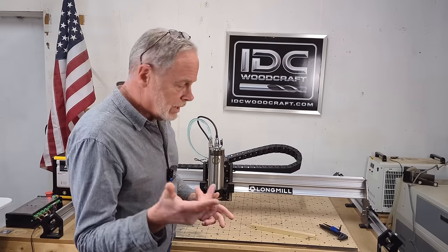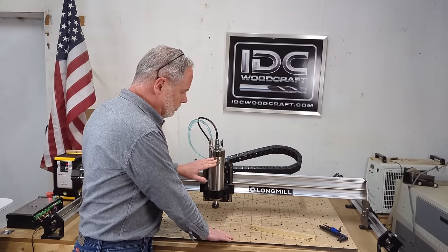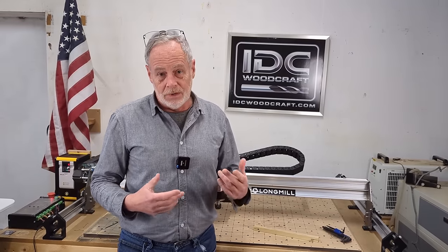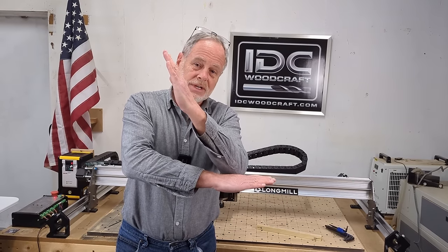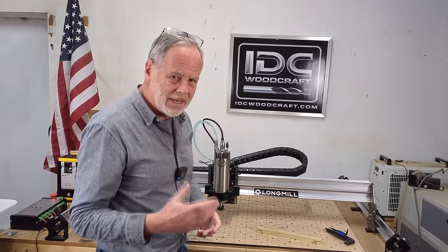There's a proximity sensor hanging down that I'll wire up later. At this point we've installed everything and know the spindle is running. There are two more things to do: first, tram the spindle so it's perpendicular to the machine; second, set up a dwell command — that's a pause before the machine starts carving because the spindle needs about three to four seconds to get up to speed, unlike trim routers. Tramming is vital — if the spindle is tilted, it's going to leave funny cuts in your project. There are many ways to tram, but we want to make sure it's perfect.